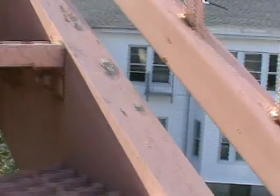The treads have signs of water penetration again. And you can see the rusted tears. But overall, they're in good condition. They need just to be opened up, cleaned up, and resealed, especially there where the frame sits on the legs of this fire escape.